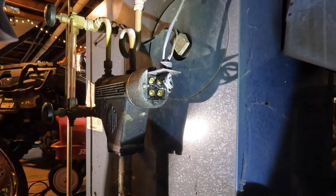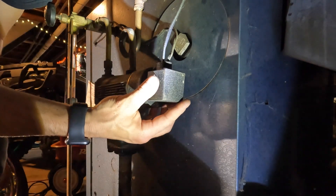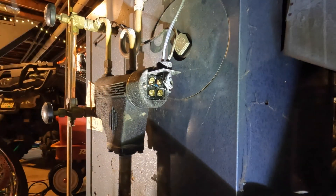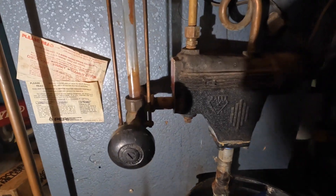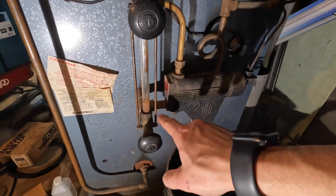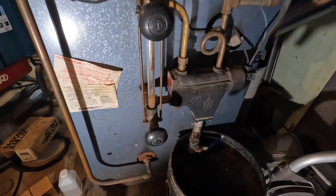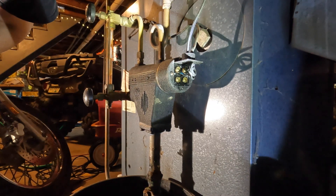Slide this cover on — it's just one screw on the bottom — and you've fixed it yourself, saving yourself probably $500 if you can get a good price on the float. As it fills up it'll lift the float and we should see some flames. There it is! I drained it with the heat on, the water level dropped down, and it cut off the boiler — so we're good. Let me know if you have any questions.